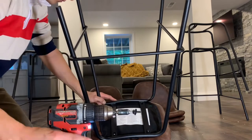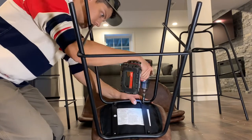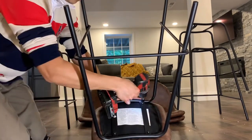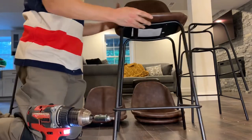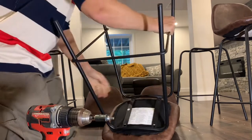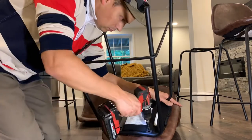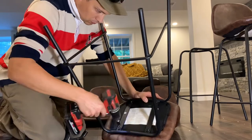The feet and base go on like that, with the open space facing towards the back. I don't screw the bolts all the way in because you want to leave the legs a little loose until the very last screw goes in. If you tighten them all down in the beginning, by the time you get to the last bolt they might not line up. Whenever you're screwing in multiple bolts into prepped screw holes or bolt holes, leave it loose so that by the last bolt hole there's a little flexibility to make sure everything lines up.